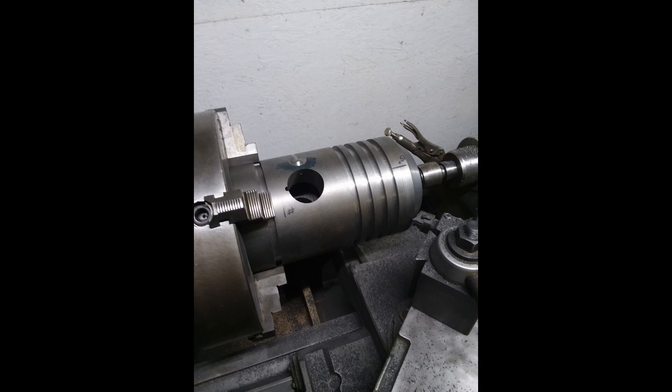Here's a picture of my setup for machining the taper on the head of the piston. I have to apologize for this section — I didn't have my good camera with me so I had to take everything with my phone, so I apologize for the quality and content. The taper is the last feature, and it allows the piston head to travel up further in the cylinder than what is machined, which effectively increases the compression ratio of the whole engine — so it's one feature of the Moguls that they had.